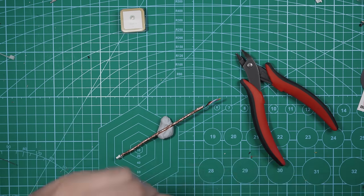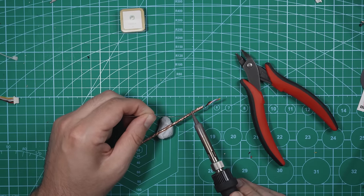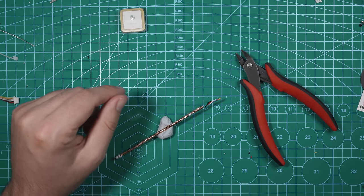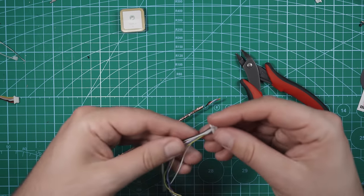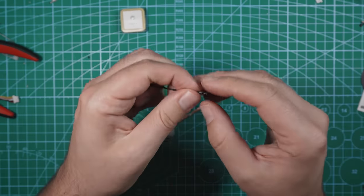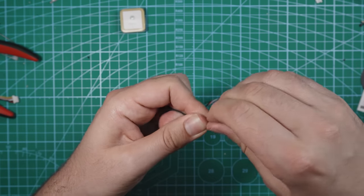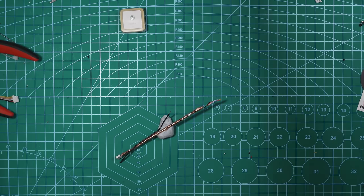And it's gonna attach to our ground. So I'm just gonna put a little solder on the copper, right like that. That's perfect. Now I'm just gonna take a loose black wire. You could use any wire. You could pull one from one of these plugs that you know you're not gonna use. I'm gonna solder this end to the solder that I just put on there. Splice this a little bit. Put some solder on this end right here to just tin it.